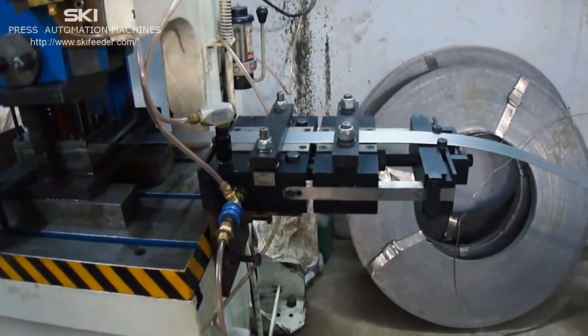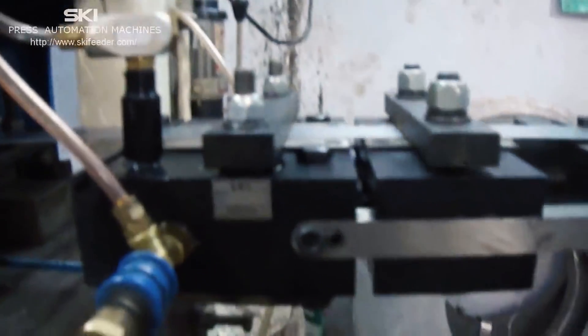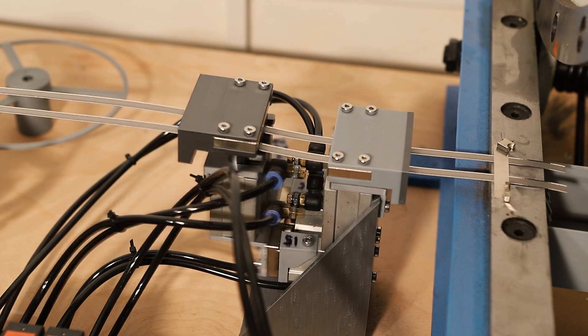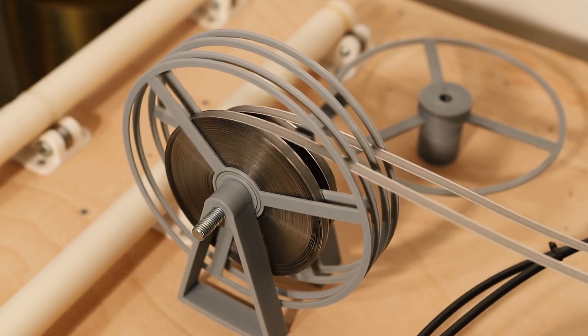So I was looking for some kind of feeder which I could use together with this shear cutter. The first approach I wanted to try was inspired by the filament extruder on a 3D printer — there is a stepper motor that rotates and you can perfectly control the length of the extrusion. Later I found a better solution on YouTube: a system made of three air cylinders. I made a prototype of this system and it worked perfectly. So I decided to use this approach. The machine worked, it was very reliable, and it produced getter pieces of the same length in a very clean way.